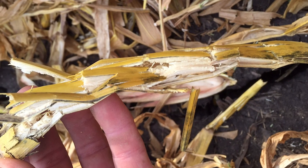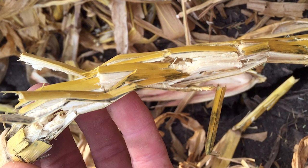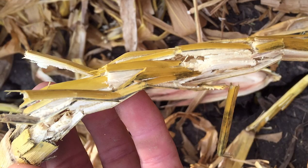This is what I was looking for. Look at the perforations in the stalk — there's a dramatic increase in the surface area, with plenty of ends where the microbes can get to work. But it's not confetti. The links of this chain are connected, so row cleaners can do their job and move them out of the seed trench.